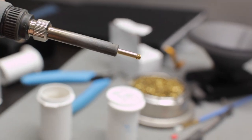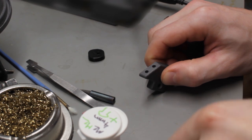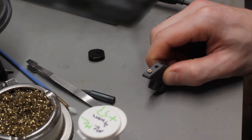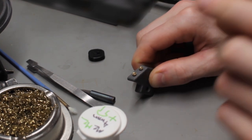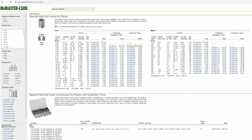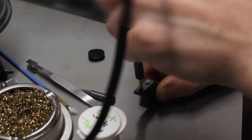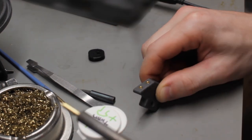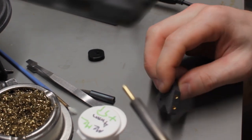Let's install — let's see if I have something to install one of these in. I've got this little part here to install two of these M2s. By the way, I forgot to mention — you actually can't even get M2 inserts for the other soldering iron. I mean, you might be able to somewhere, but McMaster-Carr doesn't have them. So you'd have to make this tip anyway. That is absolutely perfect, and it's going to make things a lot easier. There's also a bit of a reach down to the hole on this one — let's see how that goes. Beautiful. It works!